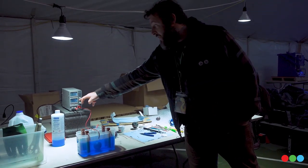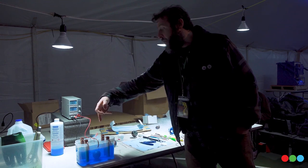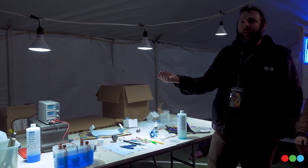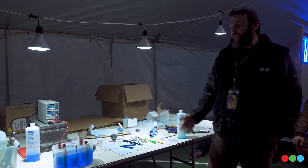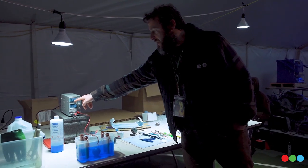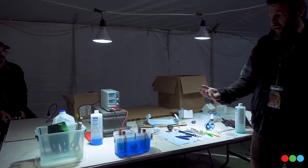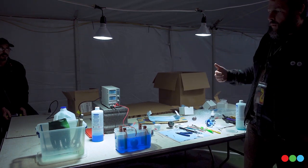if this thing is requiring me to turn it up too high to get over the rule of 0.10 amp per square inch, I'm like, there's got to be some other issue here. So it's like, filter your solution, clean your bars. If all of a sudden this was up to 0.25, but this wasn't even trying to bounce up yet, and it was wanting me to turn it up even higher, I'd be like, something is going on here with the current making the full connection.